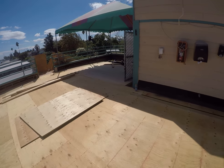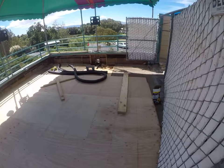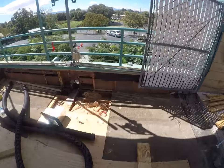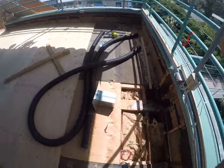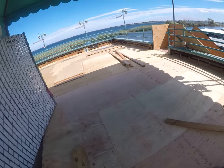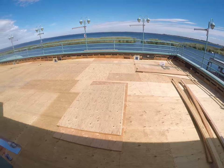We are finishing up this last section over here. And if we come in here, you'll see this is where we had a big problem with a rotted glulam beam — I'll let you take a look at it. We finally have an engineering detail on that to basically reinforce it. We have to put in a post and structurally connect it down below.